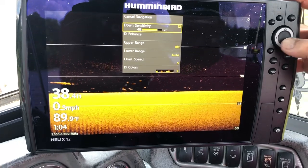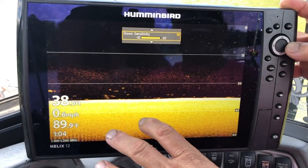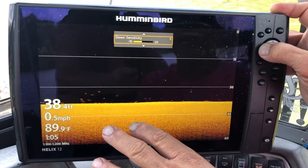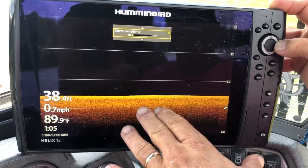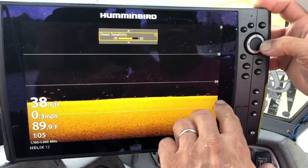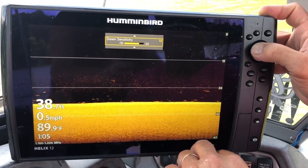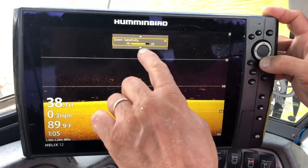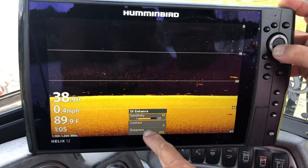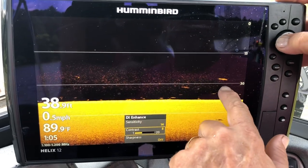We can exit out of that. Now do the same thing on it — just hit menu, go to your down sensitivity, and watch what happens as we start to go up with it. You see the brightness start to change. As we go down you see what begins to happen; if you go down far enough it gets really, really dark — that's minus 10. I'm going to come up and watch these dots and get it where I like the way it's starting to look. Now I'm going to hit where it says up and down, go down, and go to Enhance — then go to Contrast.